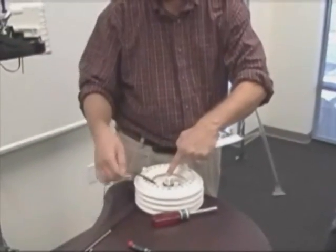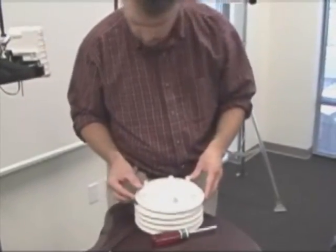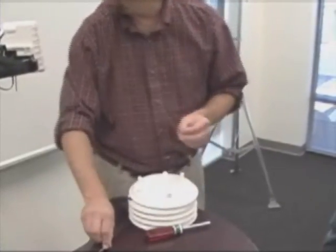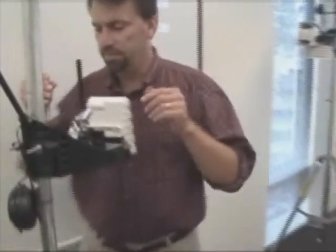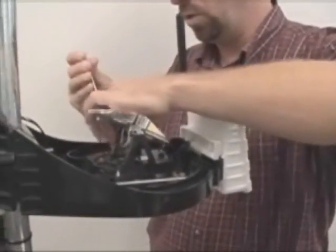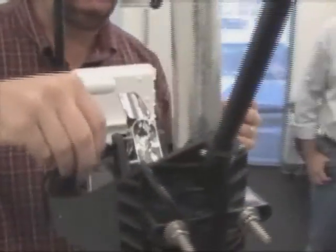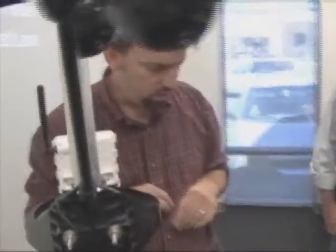The cable is going to come up and out between the first and second plate on the top. Now I have it aligned. I'm going to go ahead and put my bolts through — lock washer first, washer second, bolt through the hole. There are a few holes on the rain collector base. Pay attention to where these came from when you removed it. There are three; they're going to form a triangle and go through these plain holes right there.